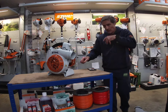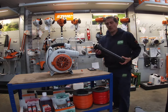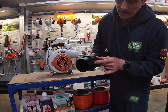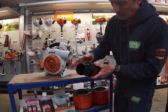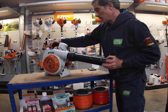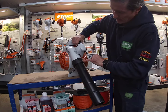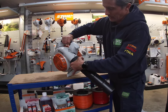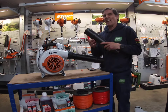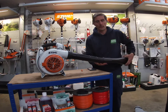Now it's already looking like a blower. You just need the straight shaft adapter, which goes on here. It has markings — a wide mark and a narrow one — so it only fits in one way, like a square peg in a square hole. Lock it in and there's a padlock symbol showing locked and unlocked to confirm it's secure. Nine out of ten people use the flat nozzle for more forced airflow; the round nozzle is more for decoration. A twist and turn locks it in.